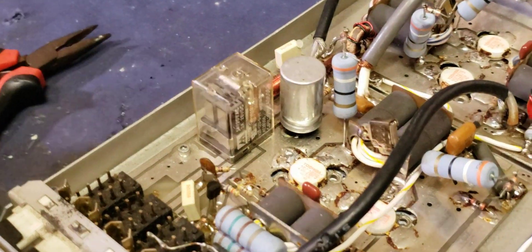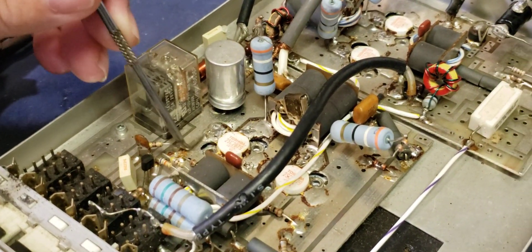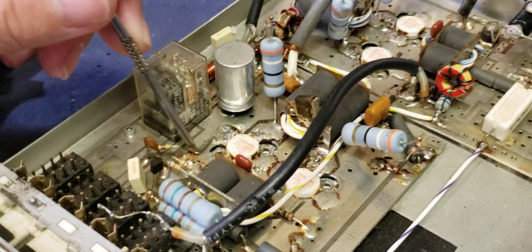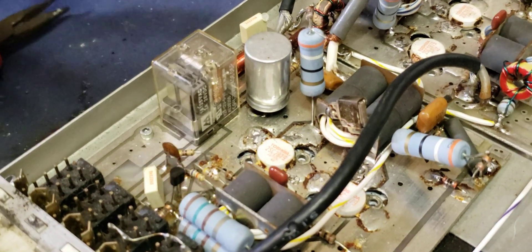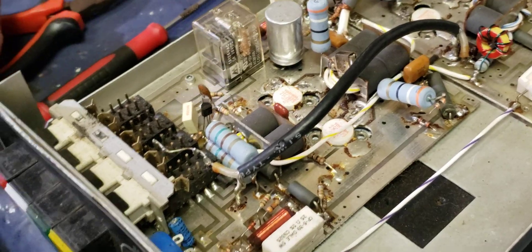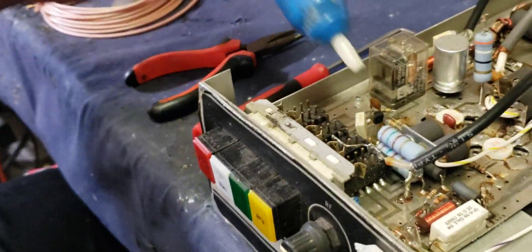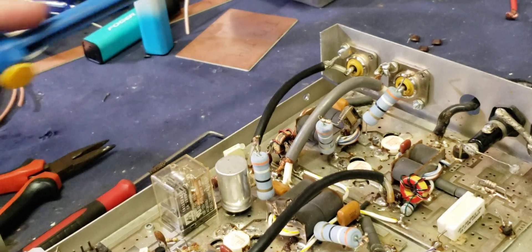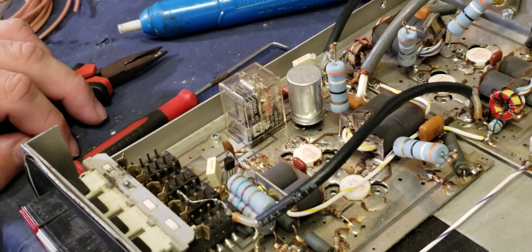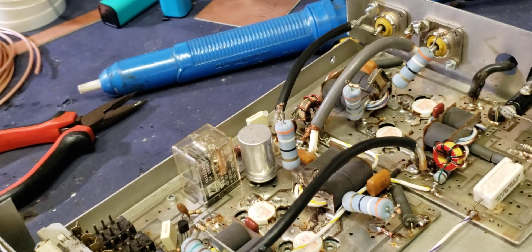This little dental-style pick is about the only thing I ever use. Many people do this different ways. First thing you remove all your screws — that's pretty much common sense. Then I go around trying to lift all of them up, and once I get at least three of them up, all you've got to do is heat the last one and pull the pill out. At times you may need to use the old trusty solder sucker if somebody's been in there and loaded about 10 pounds of solder in — but this looks still factory, so we'll see how it goes.